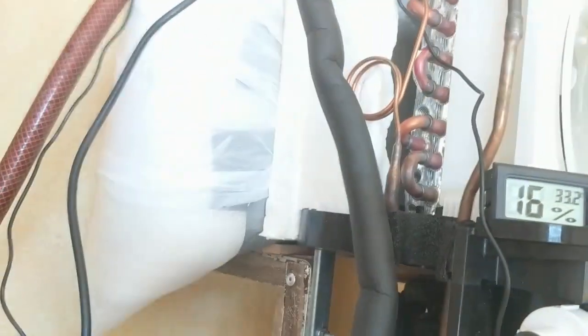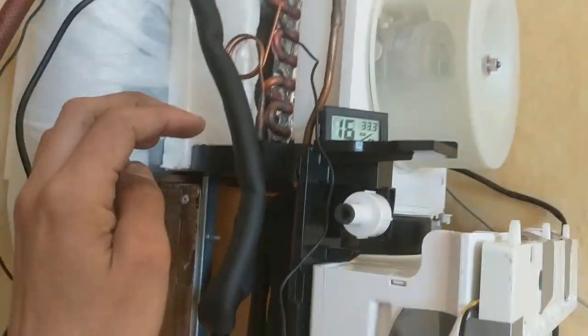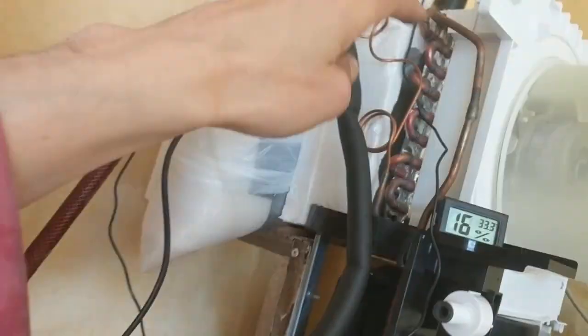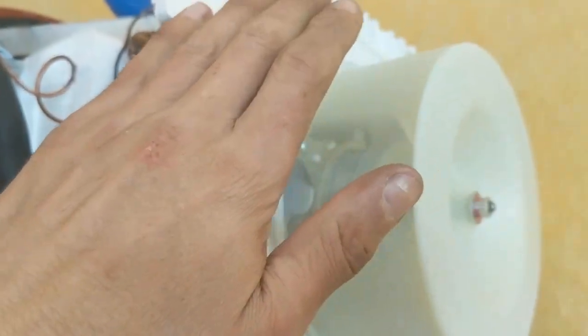By my calculations, 200–300 watts from this machine would be more than enough for the hot water tank. Total draw is about 364 watts; subtract roughly 30 watts for the fan, leaving 333 watts net. With a COP of 3, I could potentially get 1000 watts of heat, and realistically 200–300 watts would go to heating the water tank with the rest heating air.